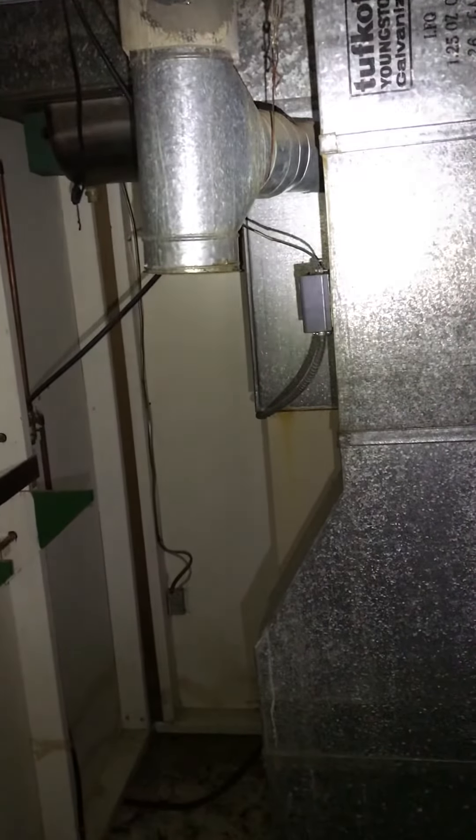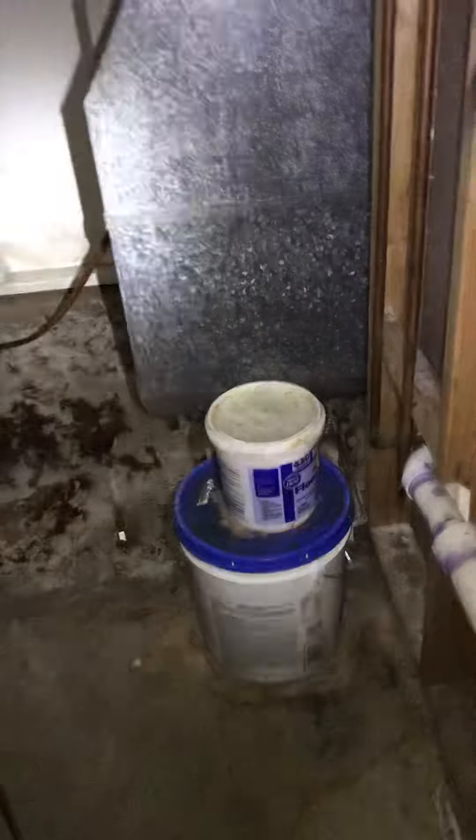You can see the flue — it's a five-inch flue coming out of the bottom with a tee that is feeding the furnace. So we need a five-inch cap and then a four-inch tee to feed our furnace.